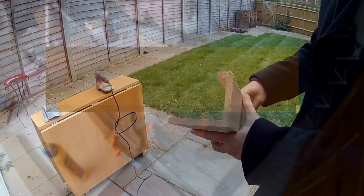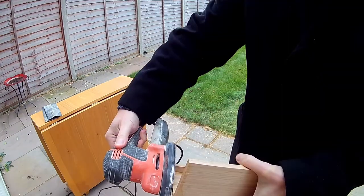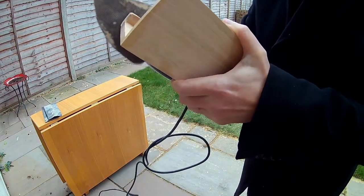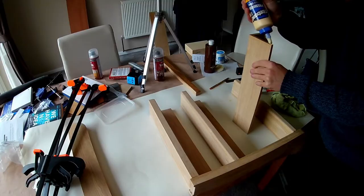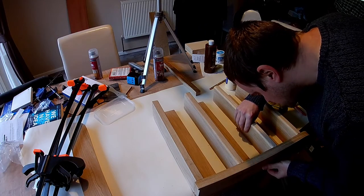I left the side panel and three shelves to dry while I thought about what to do with the fourth one. I wouldn't be able to pry it apart — the glue was far too strong — and if I tried to saw it off it would make a horrible mess and the shelf would end up being slightly smaller. For the protruding end the answer was obvious: just sand or chisel it down to size, but the other end was a bit trickier. Fortunately, I had some wood filler around from repairing an unfortunate jigsaw accident on the table. I globbed a large finger full of that on and left it to dry. Once dry, it was trivial to sand it down flush with the rest of the wood. It didn't look quite as good as the rest of the shelf, but a small amount like that won't be noticeable. I was then able to remove the clamps from the fitted shelves and glue this one in place as if I'd never made the mistake in the first place.